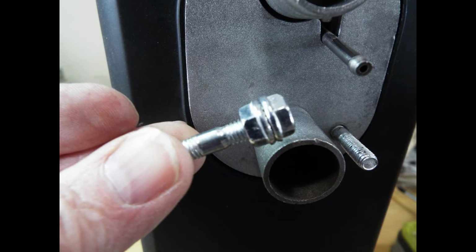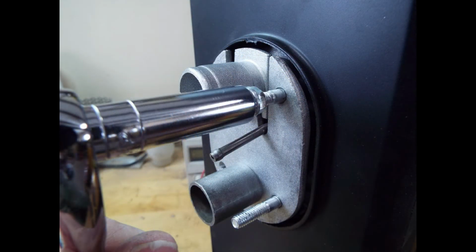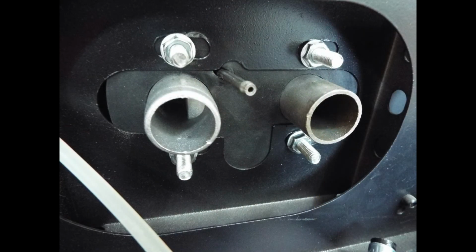So you take your 2 nuts and you put them back to back and tighten them down. Then, basically it's a bolt now, you screw that into the base of the heater until it's snug. Then you go ahead and separate the nuts with a couple 10mm wrenches, then spin those 2 nuts off, and then rinse and repeat till you have all 4 studs put back in correctly. And then you just take a 10mm deep well that you use to get the heater off the plate in the first place and tighten them back down, but don't wrench on them, just get them snug.